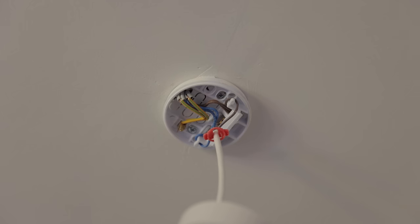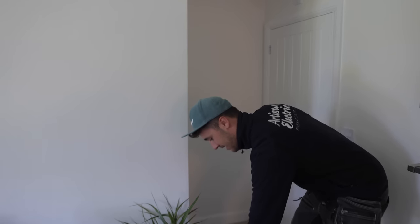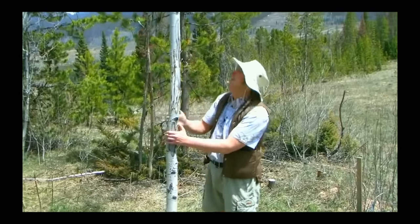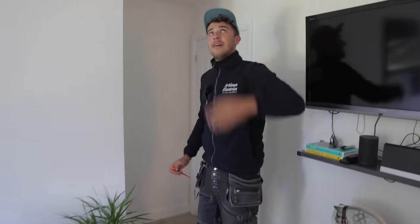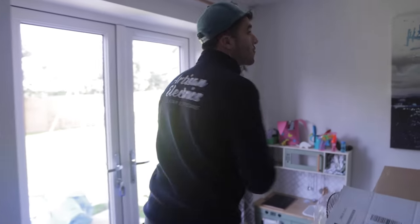This has got the feed at the switch, and you can tell that from the way it is — sorry, I was just joking. There's a video on YouTube, which I'm hoping Nathan will reference, called Bad Nature Guide. It's like, 'That over there is an aspen. You can tell that by the way it is.' But no, I'm actually going to show you in detail. If you didn't know that, well, maybe it's not too simple a video — maybe there's some benefit there for you. I can tell that because if it was a feed to the ceiling rose, it's basically the difference between two-plate and three-plate, as we call it. I'm expecting one cable in here.